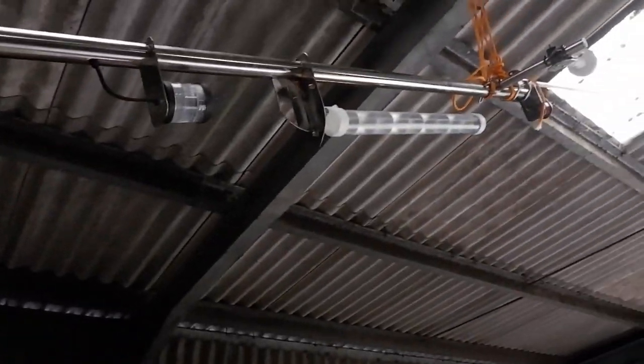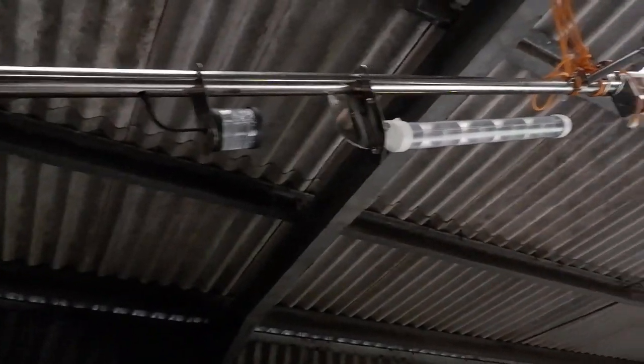Now, talk about the mastage. As you can see, the mast is already done, complete. So guys, for my lights on the gantry, I've had a good read of the collision regulations, that's for the UK, and basically I had a wee decision to make. Now, my vessel is under 7 metres and it's probably going to be under 7 knots at maximum steam, so I could have got away with an all-round white light. However, I don't know what kind of fishing I'm going to be doing in the future, so I've went for everything, basically. I've got all-round red, got the anchor light, got the steaming lights front and aft, and then I've got my navigation lights. So I'm well covered for any type of fishing that I want to do. If I ever want to go towing, I just need to stick an all-round green light up there. So yeah, just covering all the bases really.